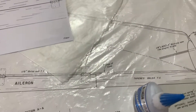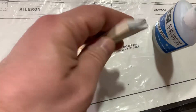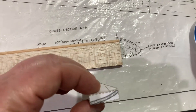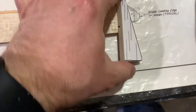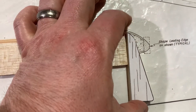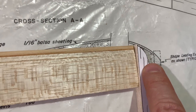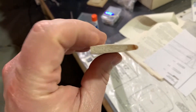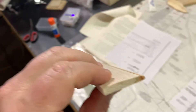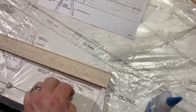I recommend doing the initial shaping first, get these on, and then you can go ahead and work on doing the shaping next. It's a little easier that way. Of course, if you want to shape it here as well, that's fine, but you can see it is thicker, so you're going to have to shape it anyway to match the airfoil. We have our airfoil shaped — just a little bit of an airfoil. Not too much. And don't forget to round off your leading edge as well. More to come.